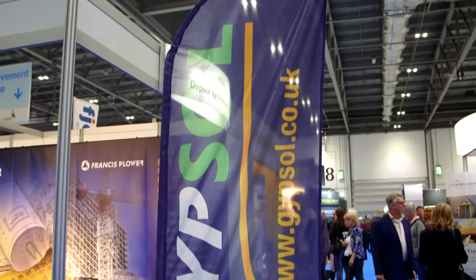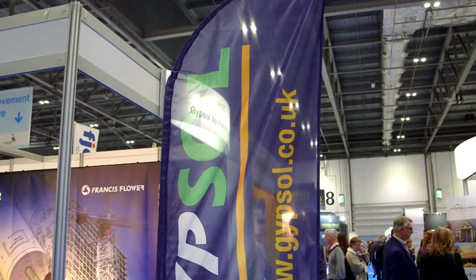I'm Alan Jackson. I'm Technical and Specifications Manager for Francis Flower, and I work for the Gypsol division. Gypsol is a brand name of the Francis Flower organisation. Gypsol is an anhydrite floor screed binder made using synthetic anhydrite, which we harvest from the acid production industry.